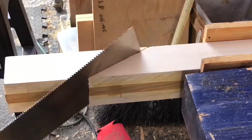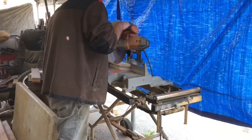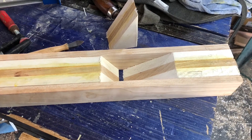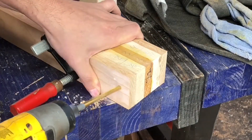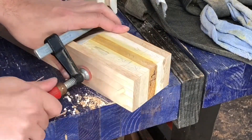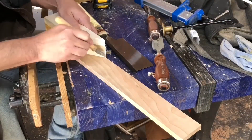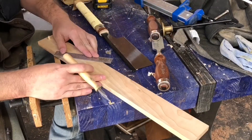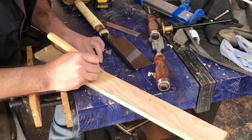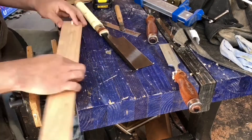The cut came out pretty clean, just a little bit on the edge. The other angle is 60 degrees so I could cut that on the saw much faster. Then I put some dowels in to be able to line everything back up repeatedly — I'm going to cut about an inch off the ends so the dowels won't be there when everything's done. Next I need to cut channels in the sides to hold the blade in place, so I'm using my marking knife to mark out where the bed is and creating a knife wall, then marking my depth.